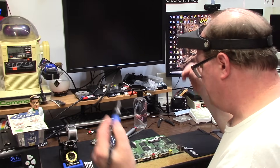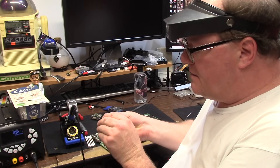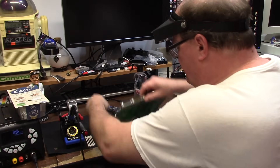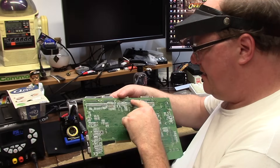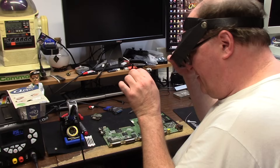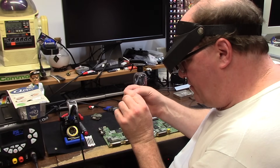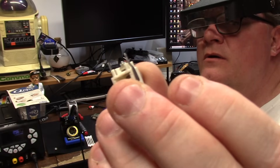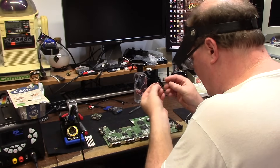Let me get this last RCA out here. An interesting find on both is solder-sucking them out — the ends are really short here. They were just solder-balled up in there; they weren't proper leg things, they were just solder balled up. So they were making contact. You can see the solder on the head but one of the leg things isn't on the front — it's just a solder ball. Interesting. They're pretty clean inside; I'll go ahead and clean them out anyway.